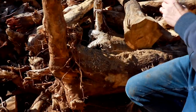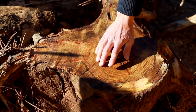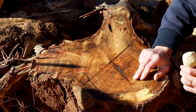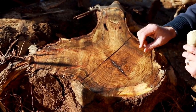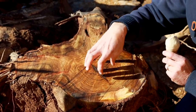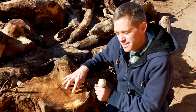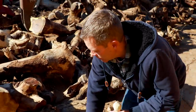We want to maximize every bit of this wood. Most of the big usable wood is right here at the base, but if we cut any closer we're gonna hit those rocks. You can see these beautiful green and black lines that just flow through here. Here's the heart check — all the pistachio logs are gonna have that. This one actually isn't that bad; a lot of times you'll get them going four or five ways, a nasty split in the middle. So we end up with pen blanks, knife blanks, pistol grips, and small parts for boxes because of that heart check.